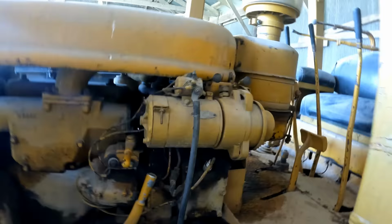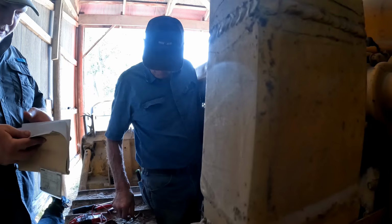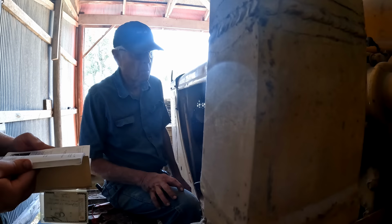Which means we can head around here to the other side now, and we should be able to see if we can get gas to come out. This is the turn valve that turns on the fuel. We'll just try to start the engine, and then I'll have to clean the engine filter here. No need to mess with the diesel until we see if this little engine runs. Make sure this makes noise, and then we go to the next step.